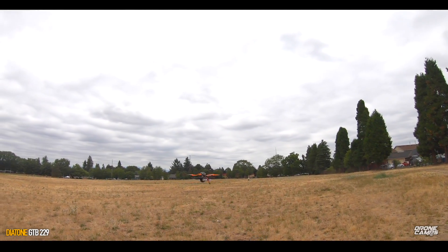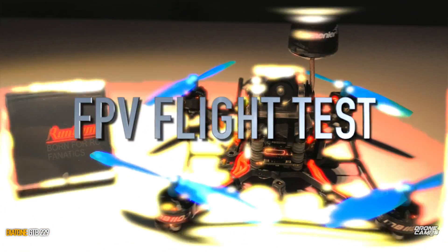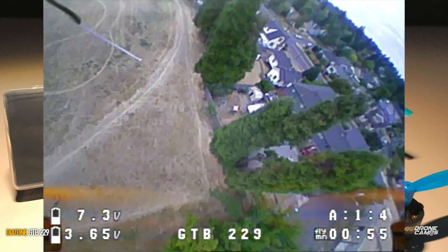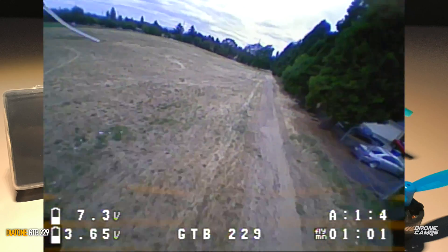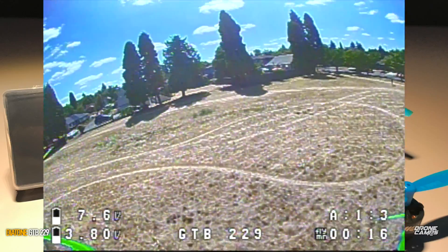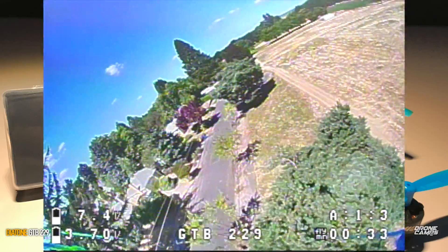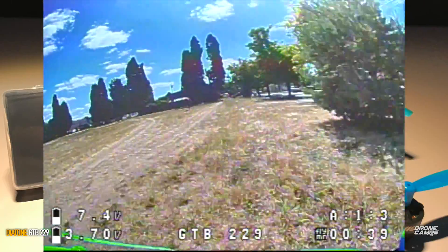This is definitely a great feeling micro toothpick. Let's do some FPV flying now. Let me start out with that Newbie Drone camera and show you the jello. This is the jello from the 65 millimeter prop setup at just above half throttle — it was terrible. Look at that jello — that is unacceptable. So I had to remove that camera and put the new camera on. Now you're looking at the RunCam Racer Nano — a much better camera. It handles lights and darks better, going under trees, has six millisecond latency, and has profiles so you can change settings depending on weather conditions.